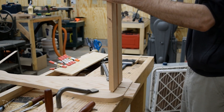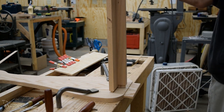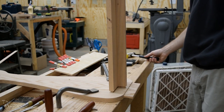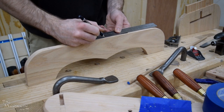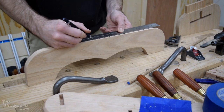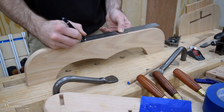And then we see if it fits. And just for consistency, so I didn't accidentally screw myself up somewhere in the middle, these are also a little bit long for the tenons, just to make sure that everything was consistent. Now what I'm doing is I have the shaped feet and I'm finding the center, and from there I measure out to find two more places further out.